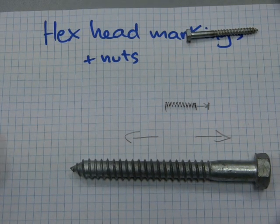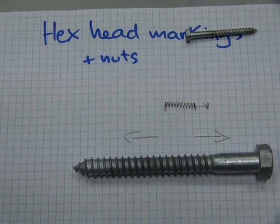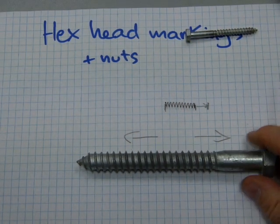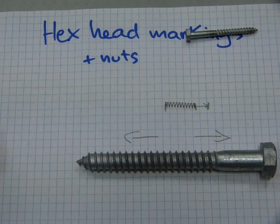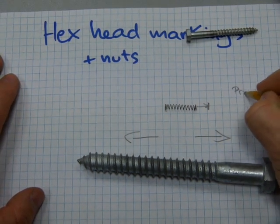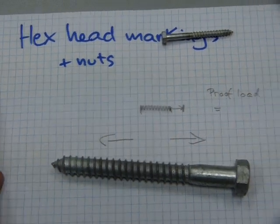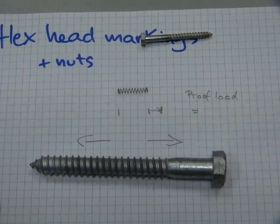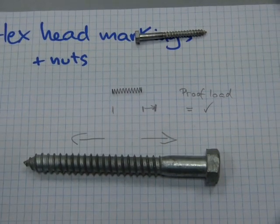Metal items, even though not coiled, do stretch a little bit and are flexible to a certain degree. Before metals break, they stretch a certain amount. The concept of proof load means that a certain force is applied to the fastener and it returns to its original shape and size. You know that you can only stretch a slinky so far — if you over-stretch it, it will not get back to its original size. Proof load is at that limit, and it's specific to the size and material of a bolt.